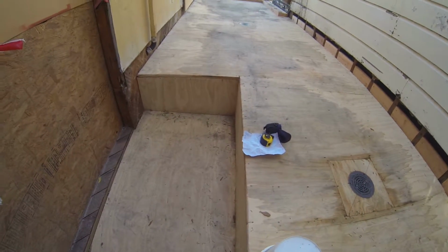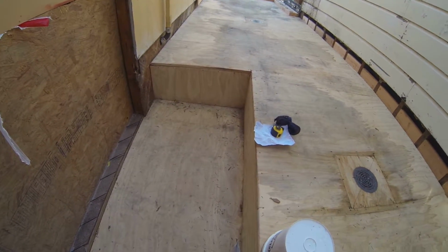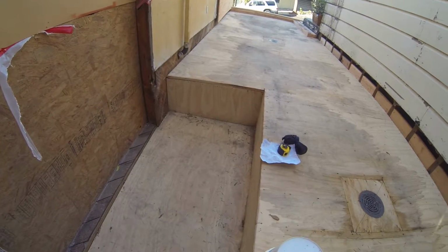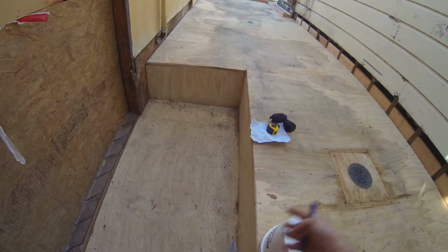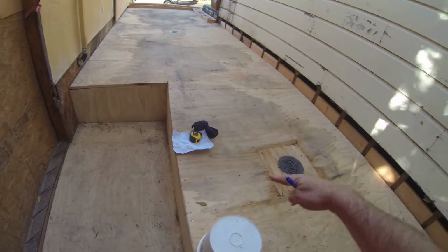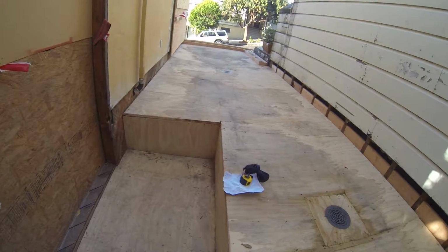This deck kind of goes in a pie shape, so it's not even, so you're gonna have to find a place to lay the line, and to me it's logical to use this as probably the layout line right here, but you need to come down 5 or 6 inches to have some overlap with this piece of material here. So what I'm thinking is you put in one straight piece here, you lap up the wall here, you come over here, that covers us from end to end.